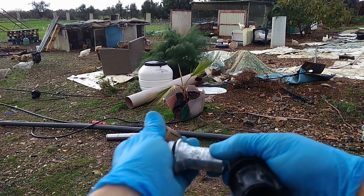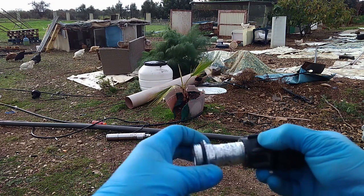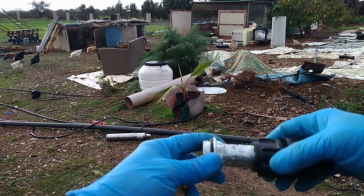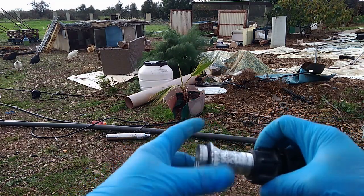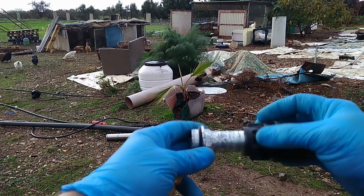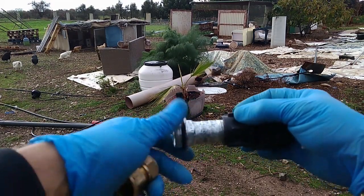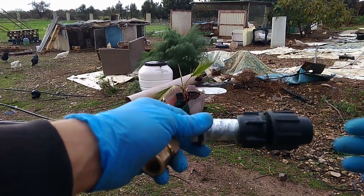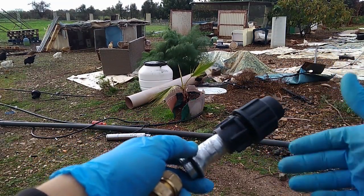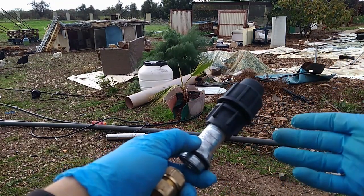Besides, you know, this is not a right way to do it, to be honest. You should always have plastic threaded into the metal and not otherwise. So this is the weakest link in this case. What, you know, for one person is a fault, for me it's a feature. Honestly, if this pump really has such a kick and really has such power, and this is going to crack, it's a fuse, you know.